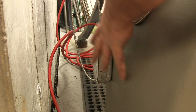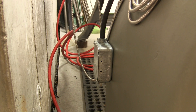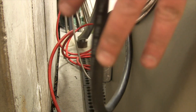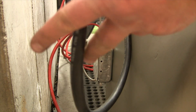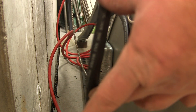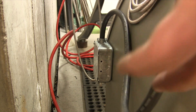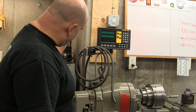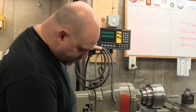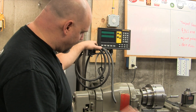Here's a shot with the box all done. The cover's on it, we got the SO cable main cable clamped in place. I left a lot of extra wire here - in the future I'm going to snip it and put a female and male plug so I could disconnect the lathe right from the VFD and move it if needed. The SO cord is now through the junction box, snaked through the conduit, and ready to be wired to the motor. I'm going to do that after I wire the VFD up.